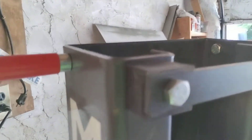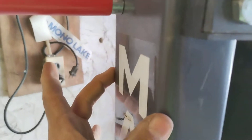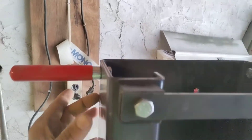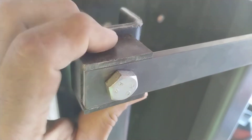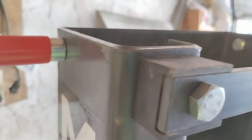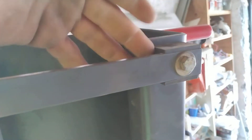I don't want to create any deflection in here. Even if I can get it on the outside, I'll angle-iron it out and wing it — that'll be a better deal. I don't want to cause any rotation either. This brace has a rubber bushing on it so it's not really doing that much; I need to close this up with something more rigid.